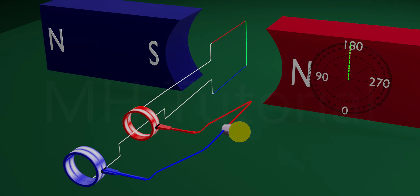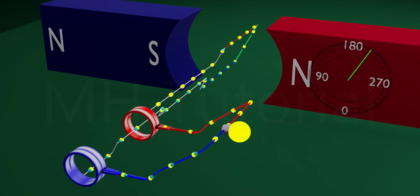Look at the blue and red arms of the armature: whichever arm is near the blue magnet has an outward current, and the arm closer to the red magnet has an inward current. You can check this current with the graphical notation too — it is a sine curve.